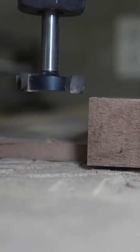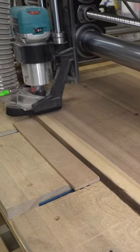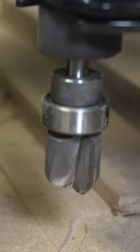This is how I make a wooden oval tray. The first thing I do is flatten the slab — for this I use a one-inch flattening bit in my CNC machine to flatten the slab.